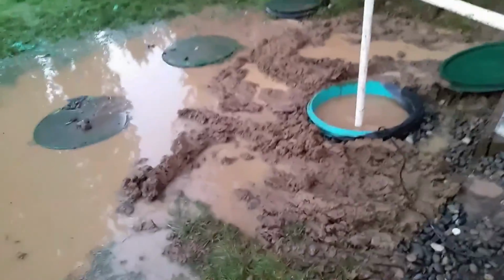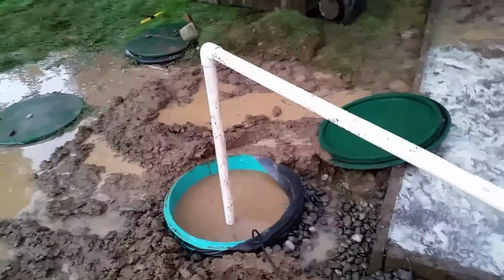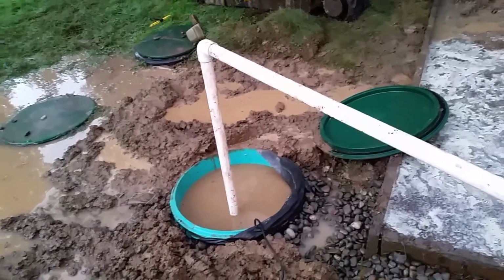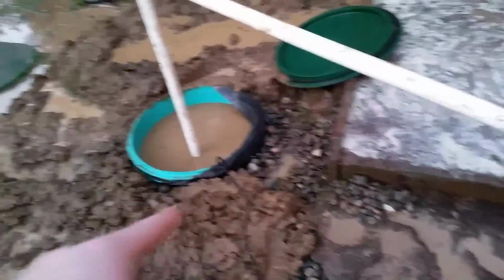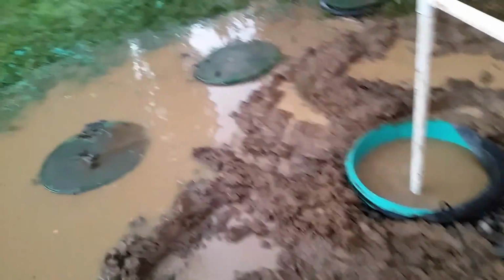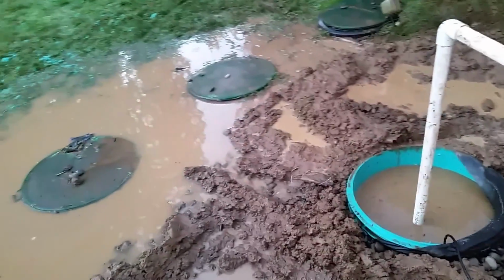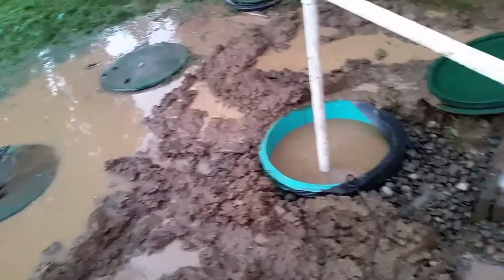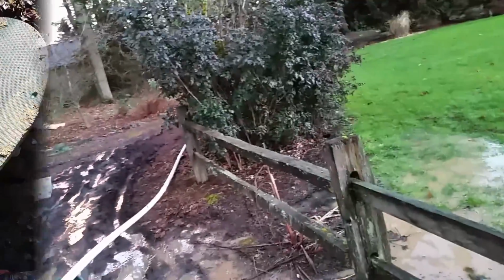The new dry well is in place, and it's working. We have an Orenco riser with holes perforated all throughout the thing, lots of them. And then we have road fabric wrapped around it. Then we've got lots of river rock all around it, and you can see it's running great. So the pump is on, and it's taking all that surface water that was going into the septic tanks, and for now, temporarily, it's going to the edge of the property.